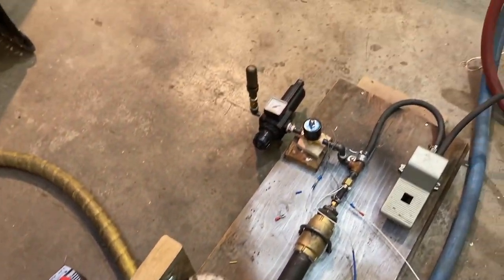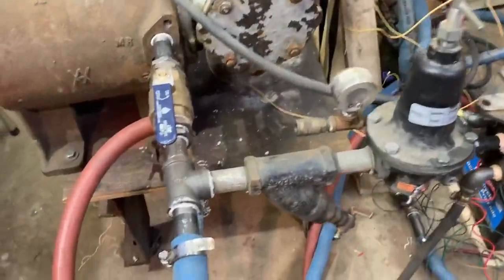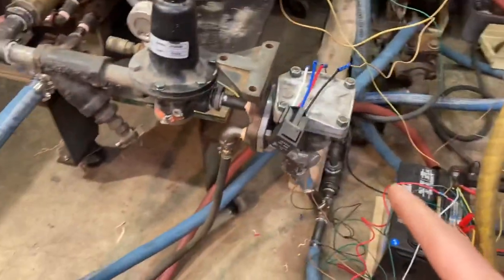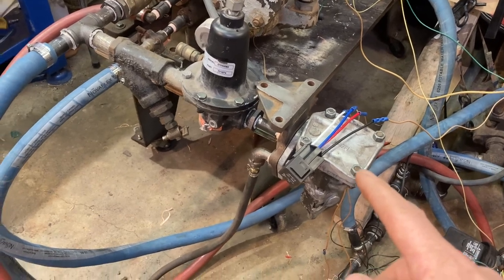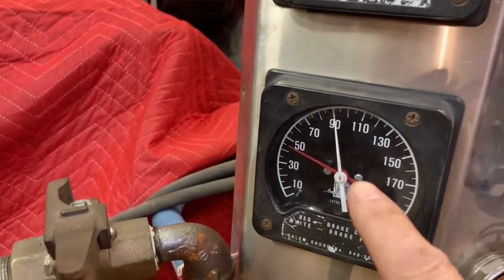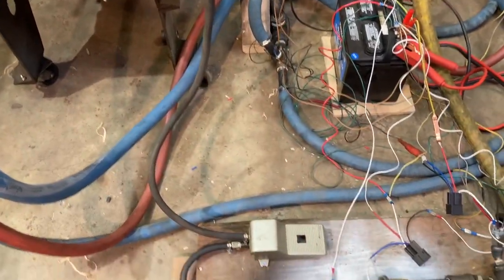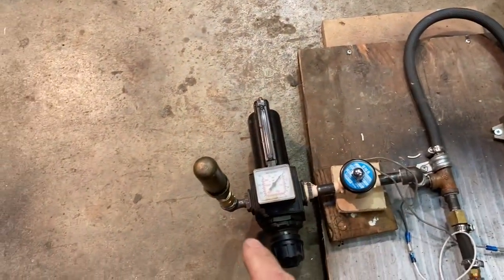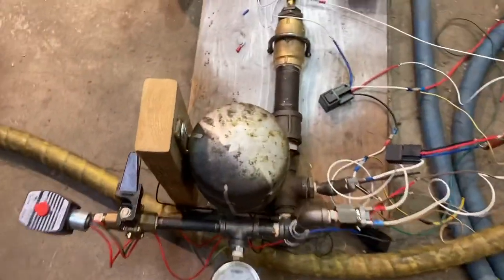With the dead man pedal that I added, it has a timing circuit and a warning whistle. The dead man system has a regulator set at 60 PSI off the main res, goes through an H5B relay valve — which means if it sees 25 PSI of brake cylinder pressure, it will stop the flow to the dead man. So as long as there is more than 25 PSI of brake cylinder pressure, you can take your foot off the dead man and walk away because the brakes are on. From there it goes to a regulator and a P whistle with a solenoid valve, through a check valve, into a timing circuit and past two pressure switches.